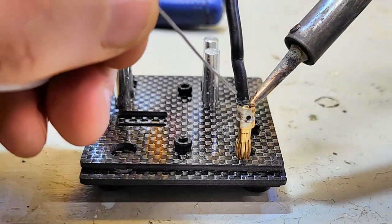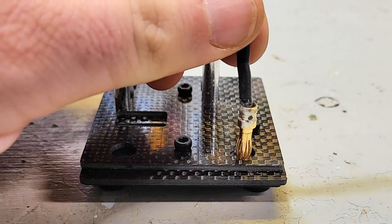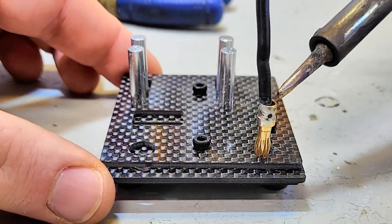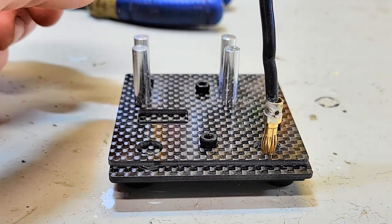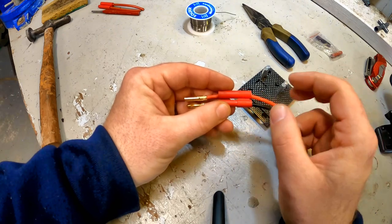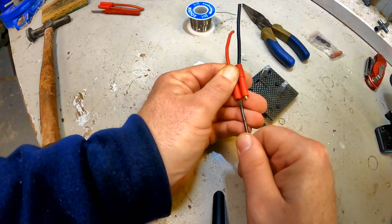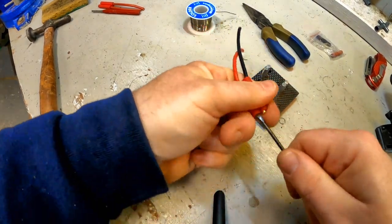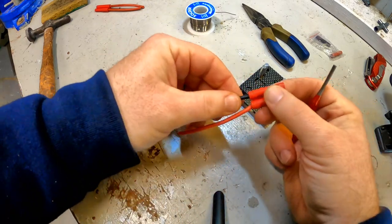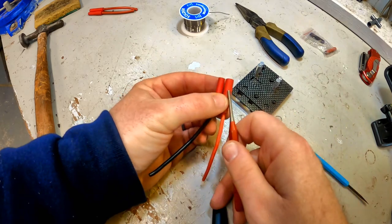You get everything hot, and put a little bit more solder in there to make sure it has something to sit to. When you pull off, there may be a little gap because you're not necessarily meant to fill this solid — but your wire should be adhered. For assembly, you want to solder with the wires already through the plug, then pull these in and push with your tool until you hear the click — then those are soldered in solid. If you need to get them out, take a screwdriver or punch on the backside and push them out the front.